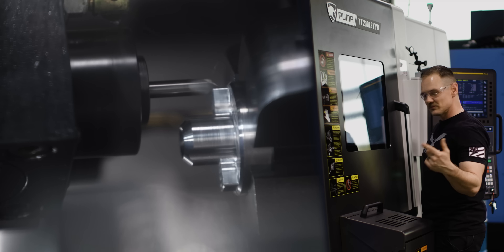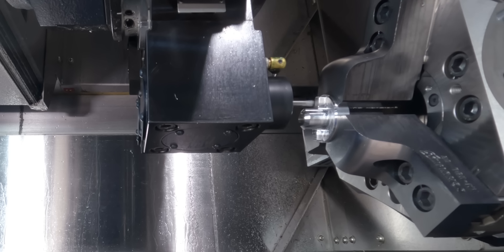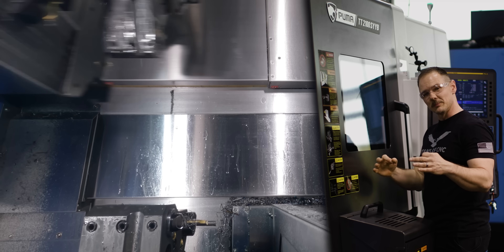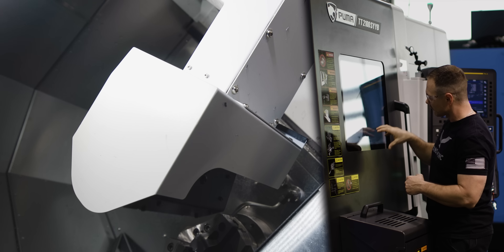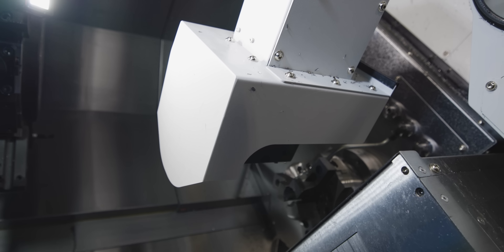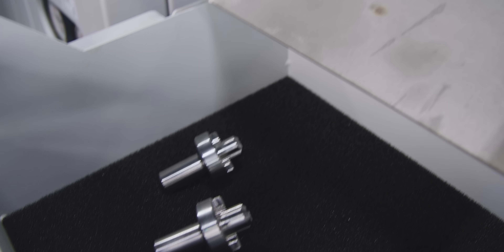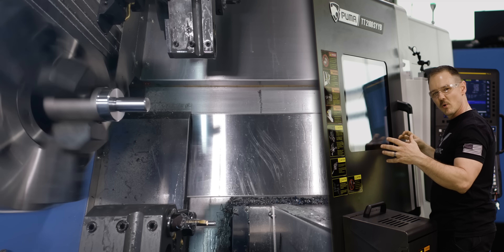On our final operation, we'll come in, chamfer up, and we'll be done. Now we need to get that part out of the sub-spindle, so we're coming in with the robot arm. It comes down, grabs the part, and drops it on the conveyor. The side arm comes down, basket comes down, the A-axis moves forward, the ejector spits the part into the basket, it draws back, and now finished parts are coming out on the right-hand side of the machine. With an open chuck, I can go down, grab the part on the left spindle, and pull out more material.